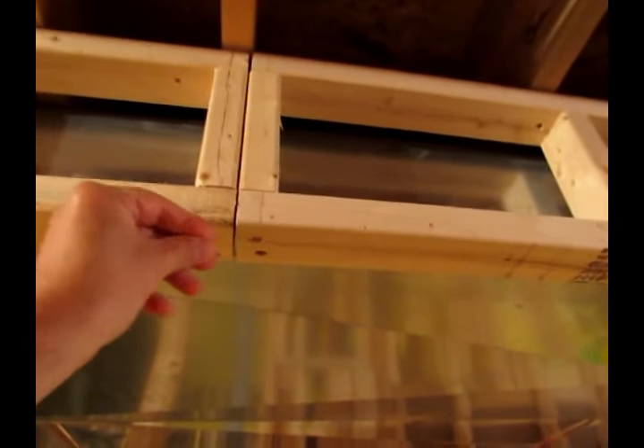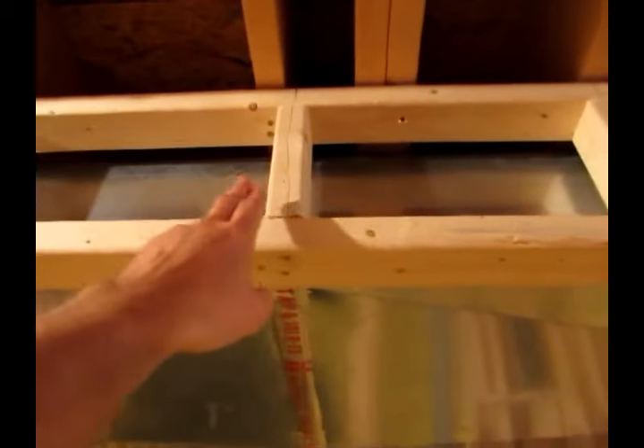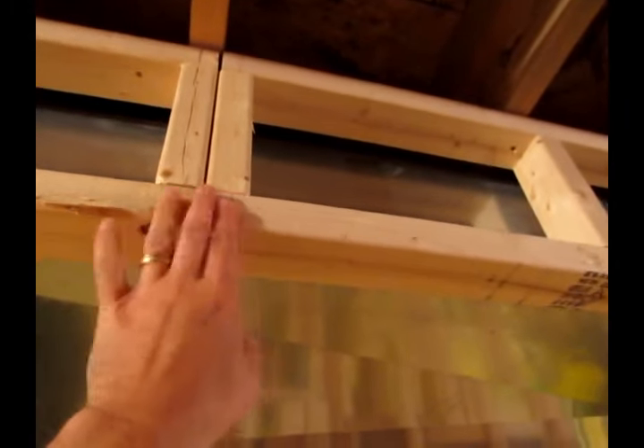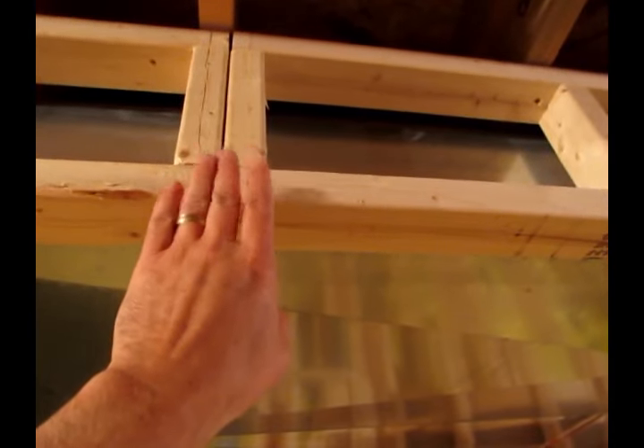By pre-building those and making sure they're stiff, I've got a way to tie them from one to the other. I've got studs on each end here. I made sure that when I started with my first one, I've got my spacing on 16s. I finish with a 16 here, and I actually measure so that my next stud here is 16 from where this one ended. This is just a filler here, and it also allows me to tie these two together, which gives me a nice secure solid piece so that these two aren't moving relative to each other.